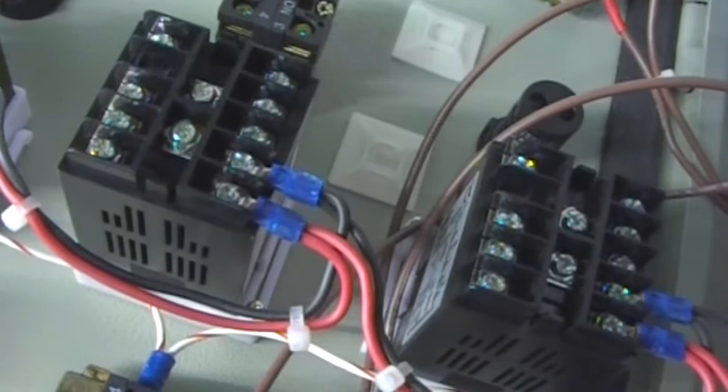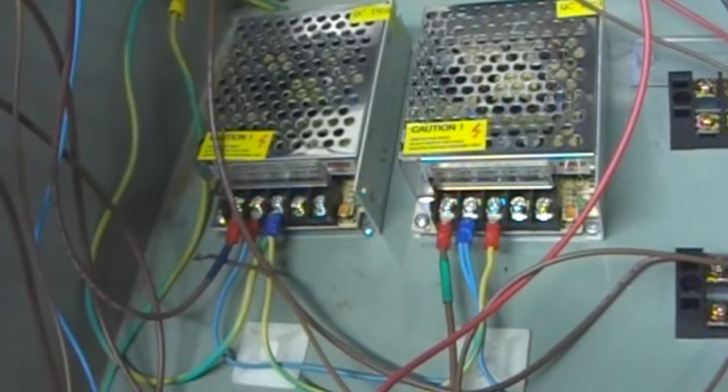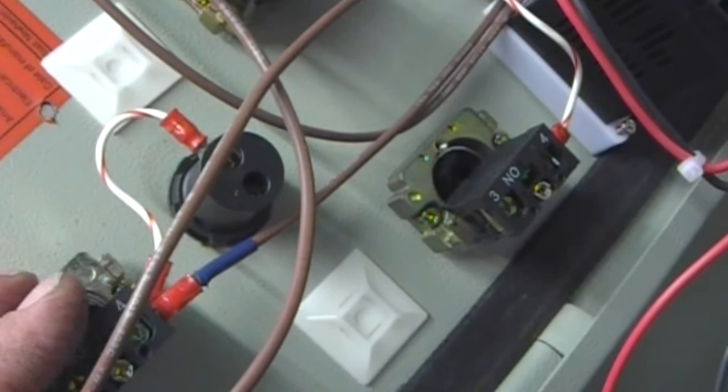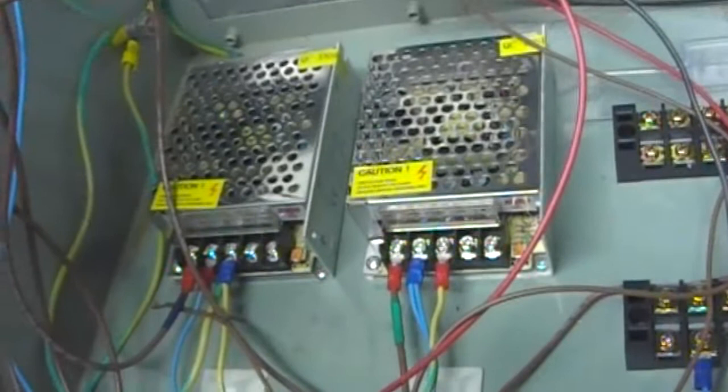And then obviously the pumps, although they are actually 12 volt as opposed to 240 or 110, because I should be using 12 volt DC pumps. So the mains is going to be switched on and off from the controls. The panel indicators are again mains, so they'll only come on when the energy is passed through the switch and is going to turn the power supply on. So the two remaining screw terminals there will go through and down to our connection points down here.